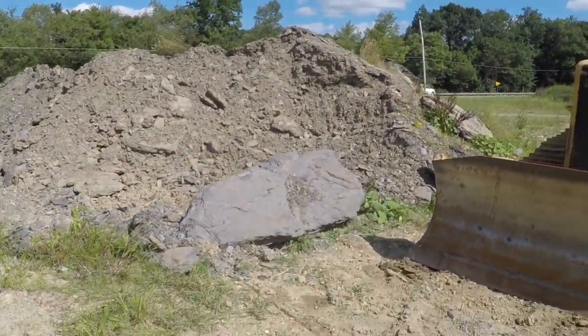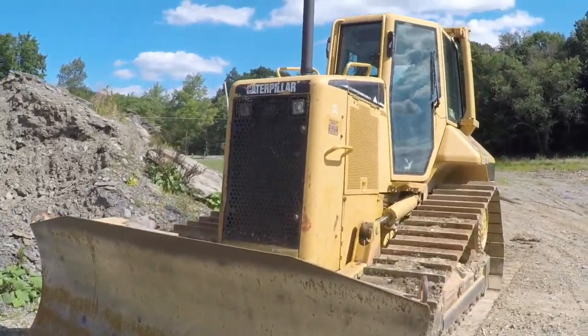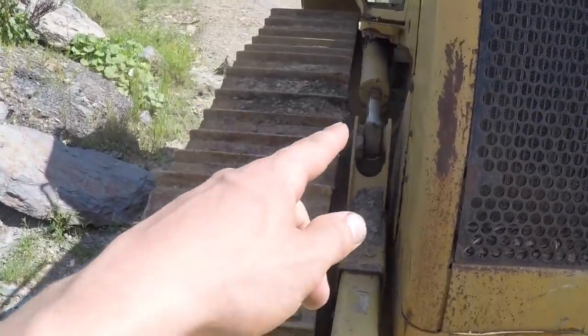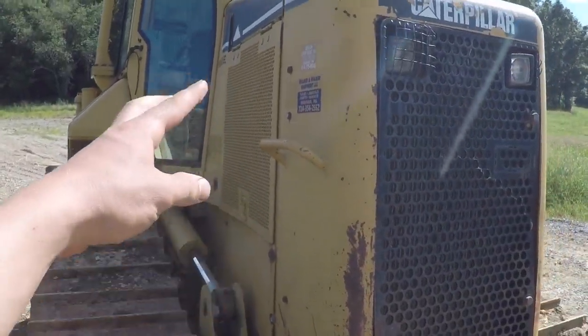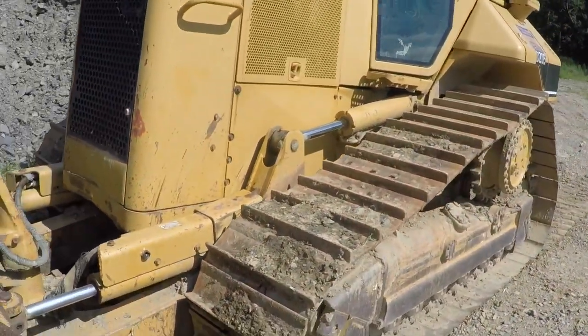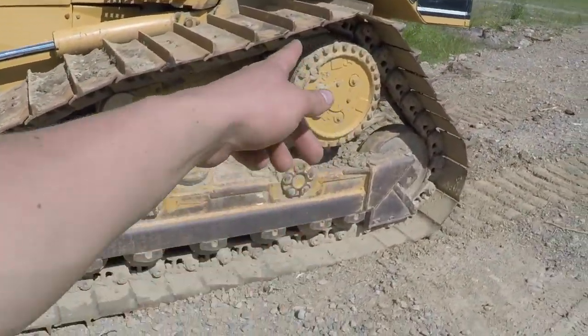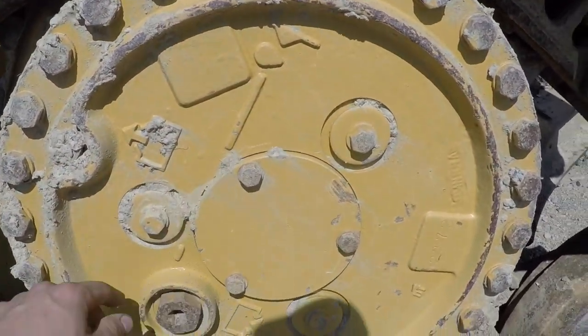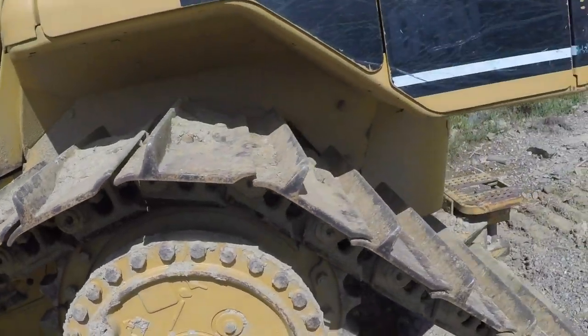Well guys, that pretty much wraps it up for this thing. We just got everything buttoned up, those panels on the bottom put back on, that as well. We got this side fixed. It was all sorts of jacked up and wouldn't go together, but she's all good to go now. Checked the oil, ran it, checked the final drives too. Just basically rotated this down, got where this is flat level, so you can check where your fill is.